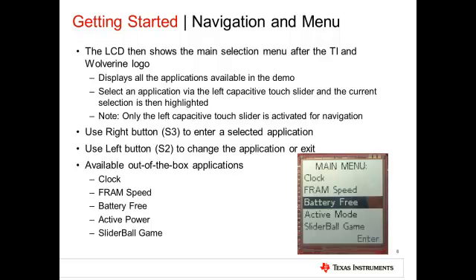You can experiment with this mode by charging the supercap and then unplugging the USB cable. Make sure the jumpers connecting the EasyFET to the target board are also removed. Now the board is powered solely from the supercap. If the capacitor was previously charged, you can see that the device continues to write to FRAM on the charge from the supercap. This is because FRAM writes have very low peak and average power requirements, making it ideal for energy-constrained applications.